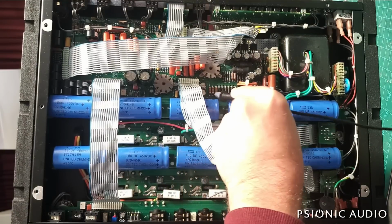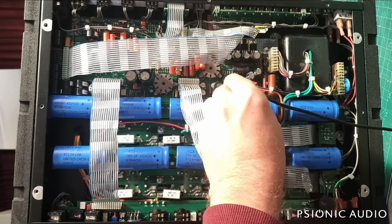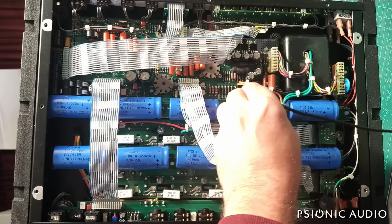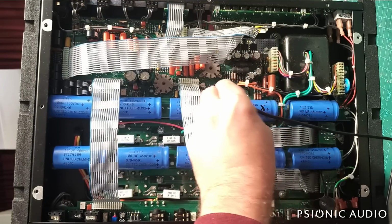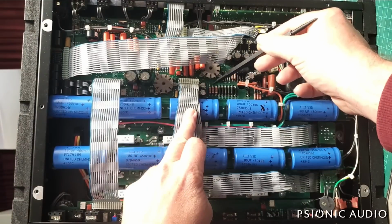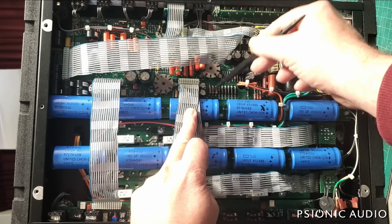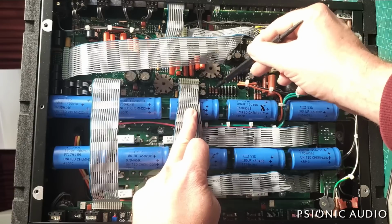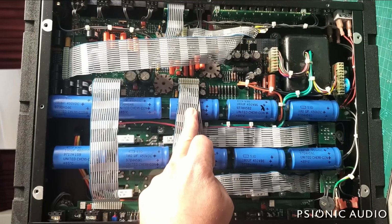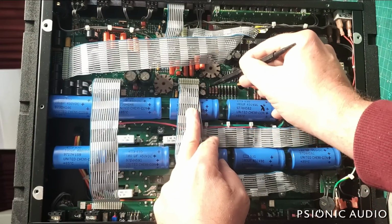And I can take this out, this little 3/4 watt. The issue is I cannot fit a 10 watt resistor in here, or even a 5 watt. So I need to hope that one end of one of these Zeners is electronically equivalent to this side. Let me get my pointer. This is the supply from the rest of the preceding part of the power supply, and I can't fit a resistor here. In their service note on the Prodigy, they show a resistor going from here to over here on the Zeners, so they can have a large resistor. And I need to see which of any of these would be functionally equivalent to this point right here.